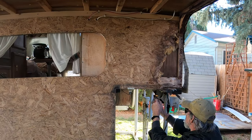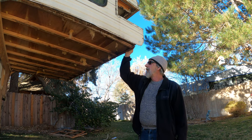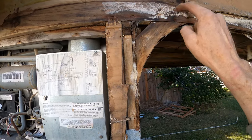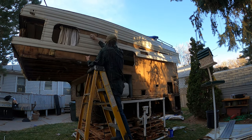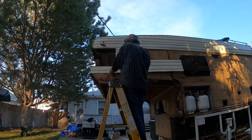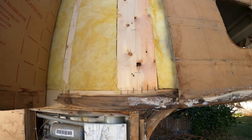There's a lot of damage, particularly around the front. I'm giving you a little preview of the next episode with me getting the skin started to be taken off. The water damage at the front is pretty bad — all the structure is going to have to be replaced from the front of the camper all the way up to the corner. That whole piece of the bottom is completely rotted. The top looks okay, but I'm probably going to replace some of the wood and do a little re-engineering. They used 1x4s for the support, and I'm going to try to re-engineer that and use some heavier lumber.